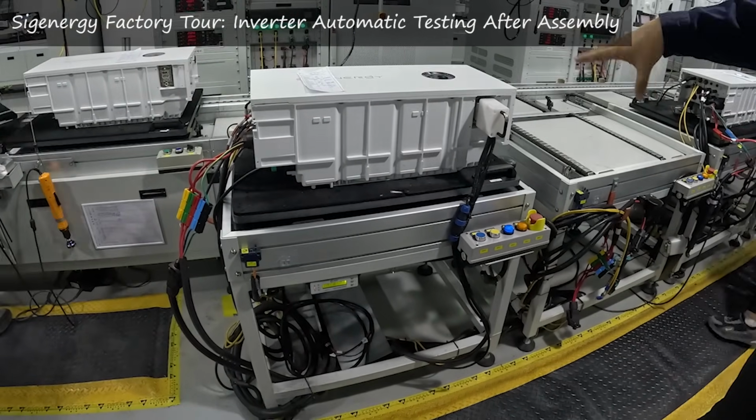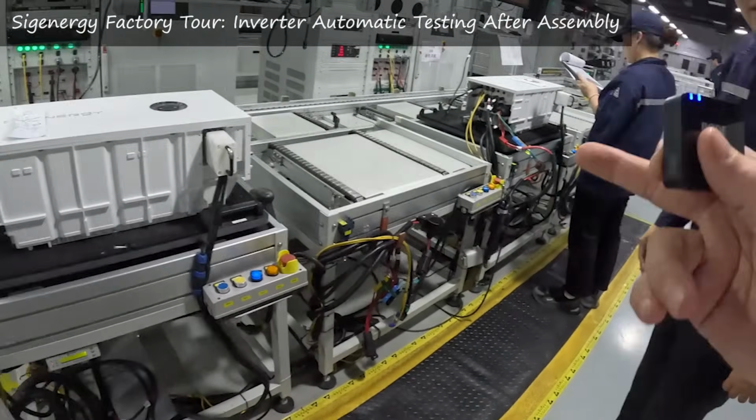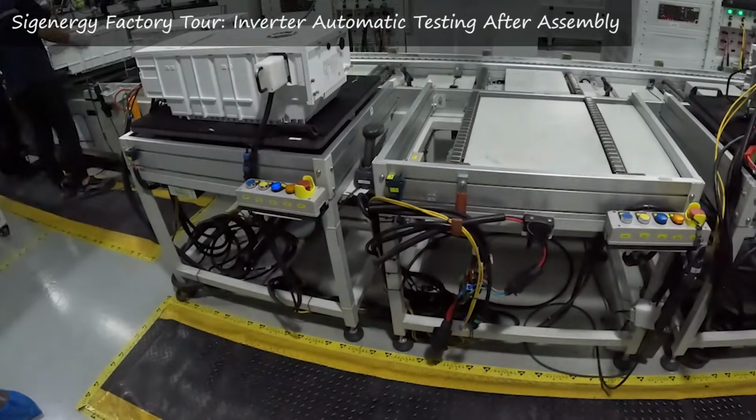I was talking to him because I was a little bit concerned. The guys come from Huawei, basically. All the intelligence comes from Huawei. I was asking Tony about the difference between using an optimiser or a global maximum power point tracker, which SMA calls ShadeFix and Fronius has as well. I think it's a really important point. Not every inverter has global maximum power point tracking. Most don't. Some say that they do, and then I test it and they don't.